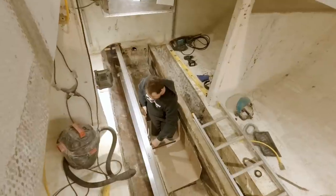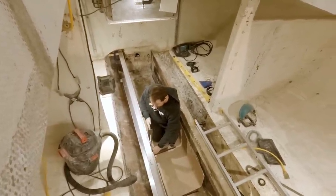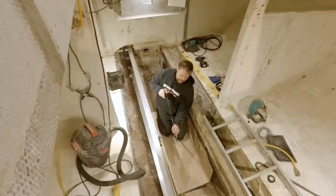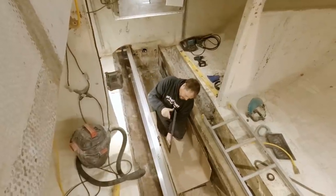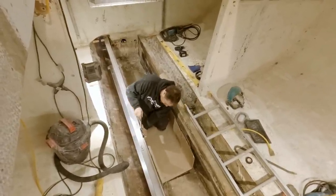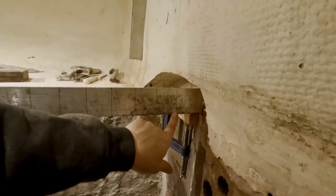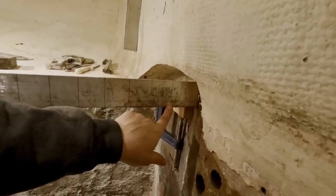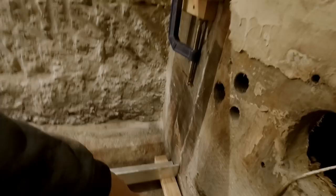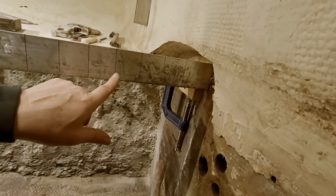And you got your T-square for that other squaring it. You might have lined up nice and straight when we got this all set up. Yeah, this other T-square is just making it easier. I did put straight marks on here. It just makes it a little bit easier. Yeah, so I just came out 3 inches from the bulkhead there and started there. And that'll be close enough down here. And then just every 2 inches is a mark.